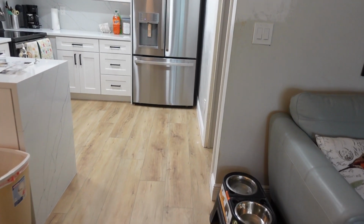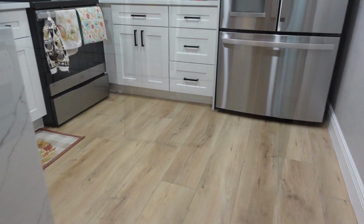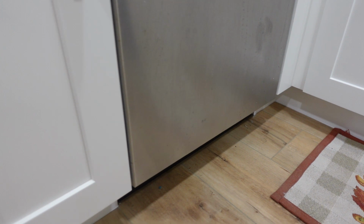And as we enter the kitchen, you can really see in the light here the nice colors of this floor. And of course, if you know me on my channel, we don't use any kind of thresholds around cabinets, and we cut it perfectly around all the cabinets. We use toe kicks to cover the edges where we can, and then we just caulk along the countertop there.